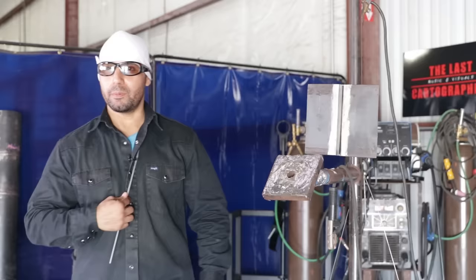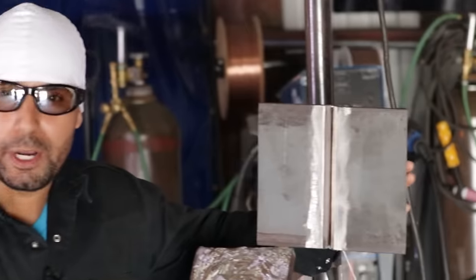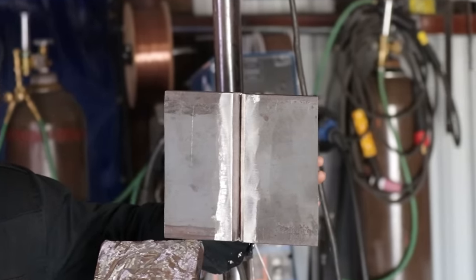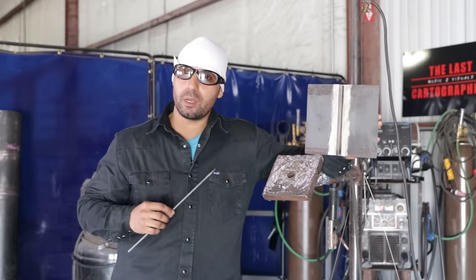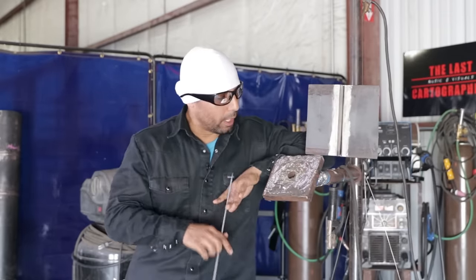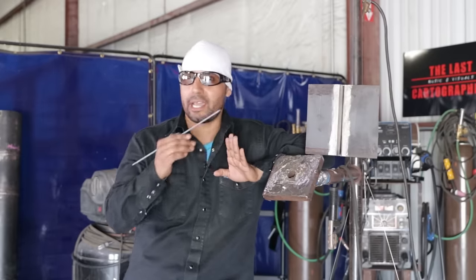All right, once again, welcome, WellTube family. My name is Rosendo Rodriguez, your new instructor for the night shift. I got a half inch plate right here that we're gonna work on. It's gonna be a 3G open root. We're gonna go uphill. On the root, I have a little different method of doing my root. It's a little side-to-side motion.